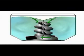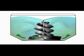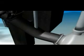After completion of the slushing operation, pulp from the pulper is discharged by opening the pneumatic operative valve. Pulp is diluted to 4% consistency by simultaneous addition of water before feeding into the dilution pulper.